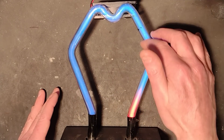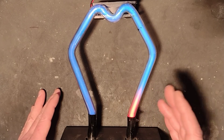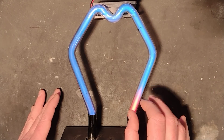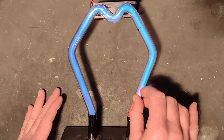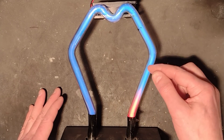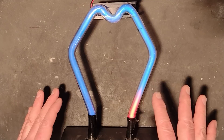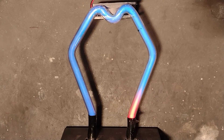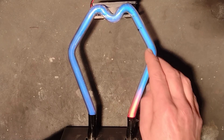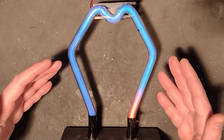I'd like to have shown you the orange tongue much further up, but I can't because it takes a while. When you've had it off for a while, the mercury vapour settles back down, and it happens at a microscopic level — it just gradually migrates up. I also have to be careful not to bump it; there are tiny little beads of mercury here. If one of those finds its way down, the red will disappear and it will just go into a completely blue tube. But when it's been up for a while, it does go completely red at one side and then transitions with this little tongue into blue at the other side.